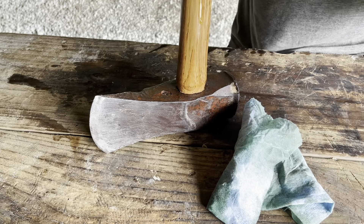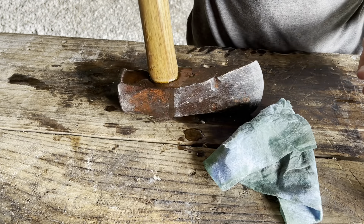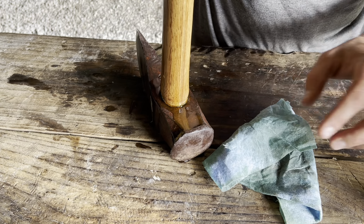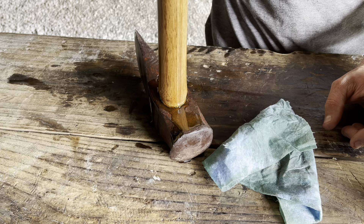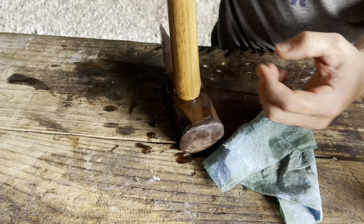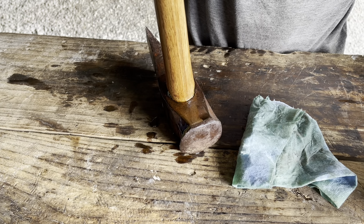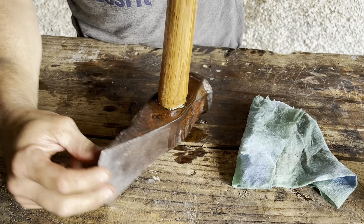What I'll do when I put some oil on — I'll pour it around the head like that, and then if there's any gaps at all I'll let it run down in there. I don't see any gaps at all; there's a teeny tiny one there in the back that doesn't even go all the way through, just right here at the very end. I'll let that soak in there for a while — just let it sit for five to ten minutes — and then I'll do the same thing on the top of the axe, on the end grain right here. A lot of old-timers soak their tool handles in water to make sure that they swell up and stay tight, but you can do the same thing with oil, and the good thing with oil is it doesn't evaporate. It will stay in there.